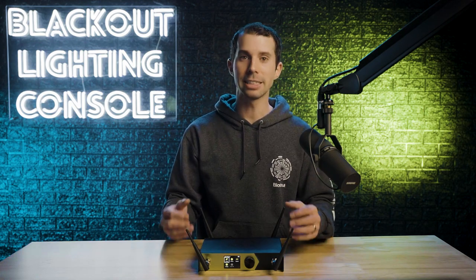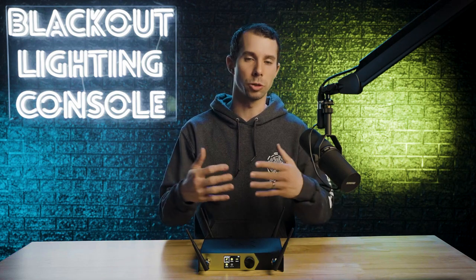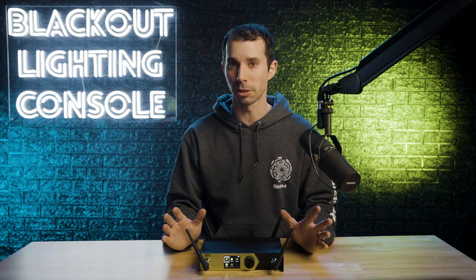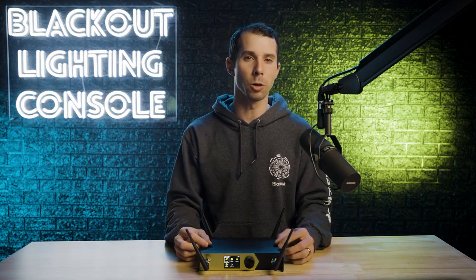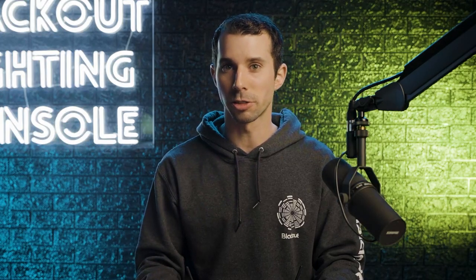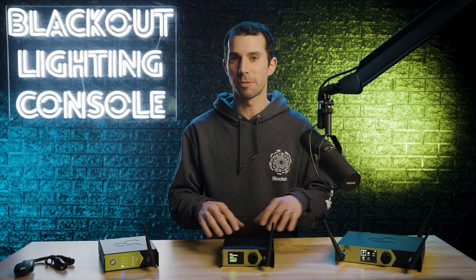LumenRadio recommends against having multiple devices with the same linking key in the same area, which makes a lot of sense because they can get confused with who is transmitting signal and causing your lights to flicker. But I have a friend who particularly likes to exploit this with his Stardust, where he uses two in the same area to essentially extend coverage. Apparently, it only works in regular CRMX mode, but they both have the same linking key. That's a pretty interesting use case, but this is again not recommended by LumenRadio. Now, all of these transceivers support RDM and have cognitive coexistence with Fleet Alliance.